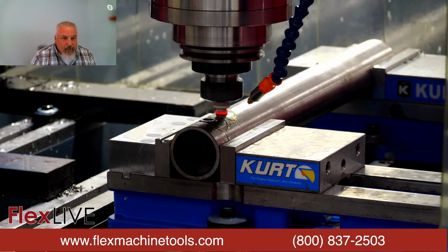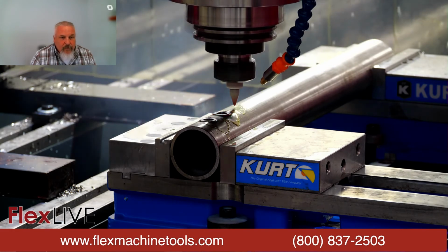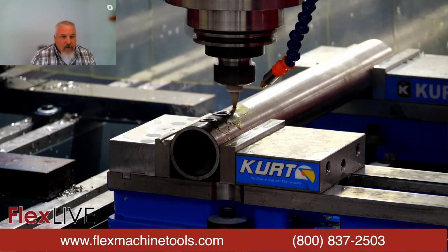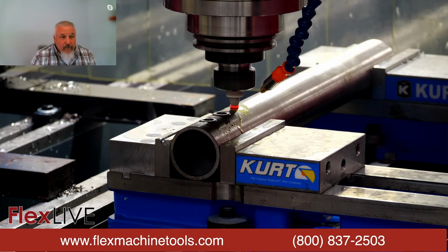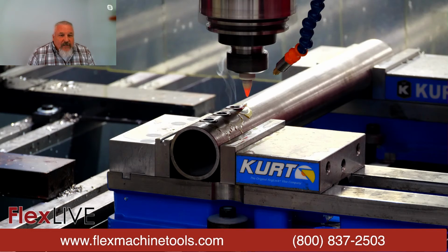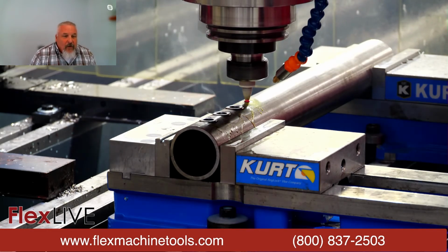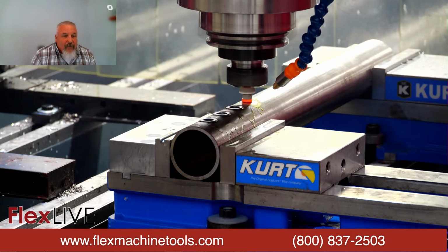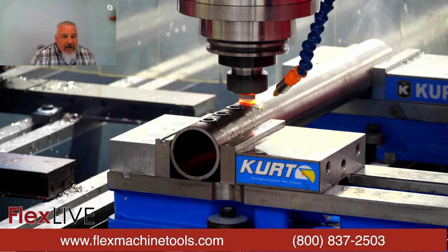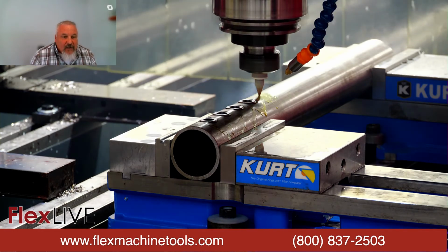Beautiful, beautiful. Spoke like a true expert. So while we've got this live video going on, tell us, for those who don't know, and much like myself who just learned in the last couple weeks, what is flow drilling? Flow drilling, what we're doing is taking a tungsten carbide tool. We buy it in a raw blank form, and then we grind our geometry onto it. It's a solid tungsten carbide.